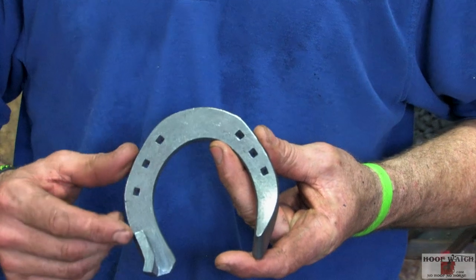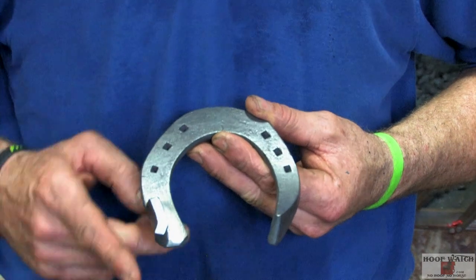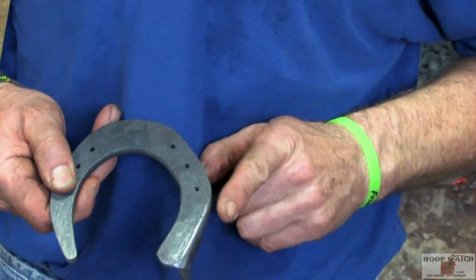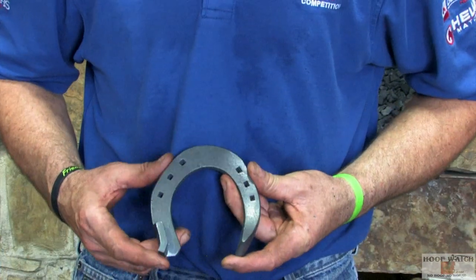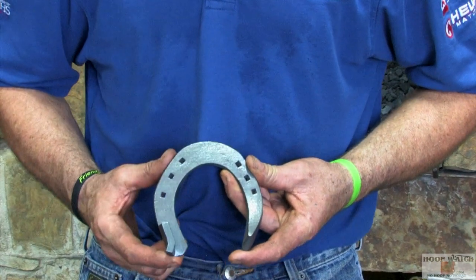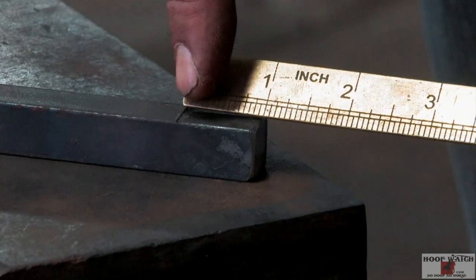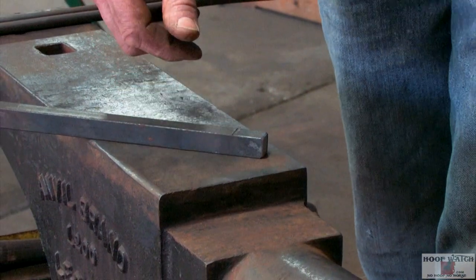This shoe is punched for 6 E3 slims. So we've got an unusual trailer that's elongated. It looks like a trailer and kick on the ground surface, but then when you look at the foot surface, it's just widened with the boxing going through that edge. This shoe measures 4¾ wide by 5 long, and it's measured from the lateral heel, so it could fudge a little bit. We're not gonna put a center punch mark on it because the toe will be moved back and forth, but to make the lateral heel caulk, we're gonna score it at 1 inch.